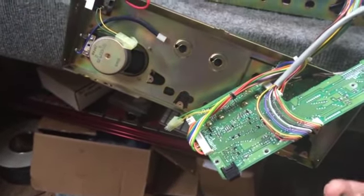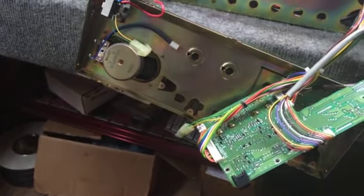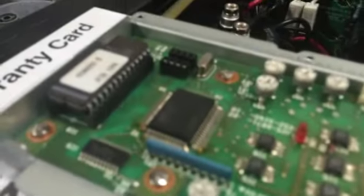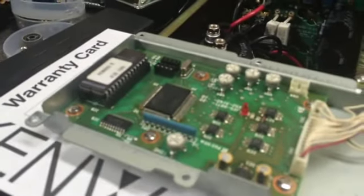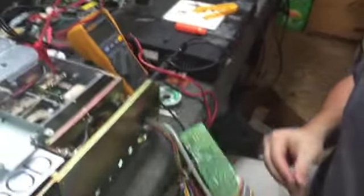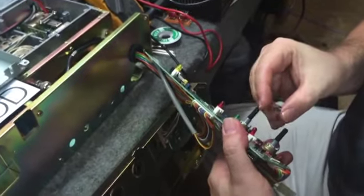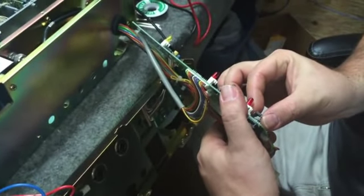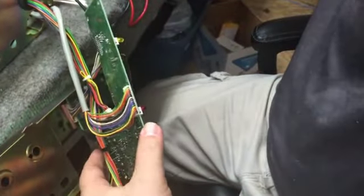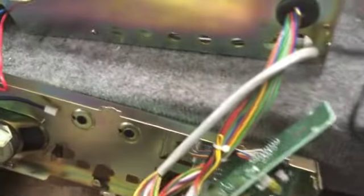I'm going to go ahead and put this chip back in, and I have to rewrite the data on the chip that's actually inside of the control. It's the same little chip that does the frequencies. It's a 93C46. It actually contains the PL tones. Alright, so this repeater did have a PL tone, and it was not transmitting anything whenever I would key into it.